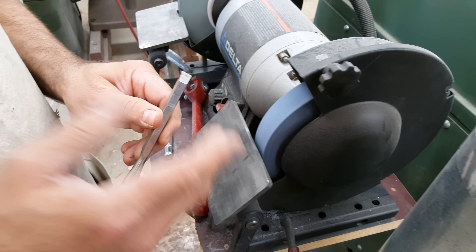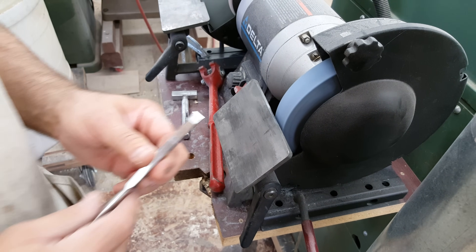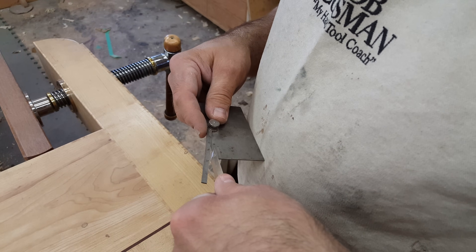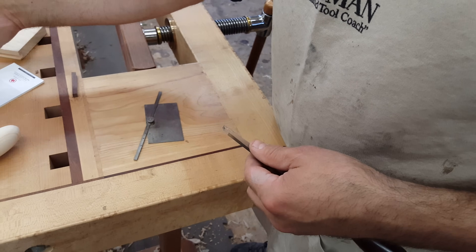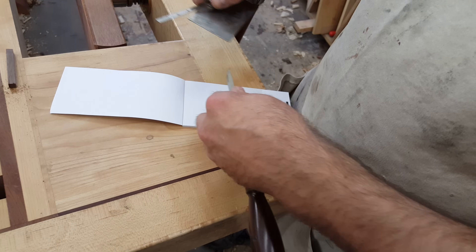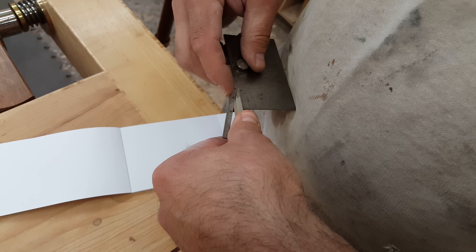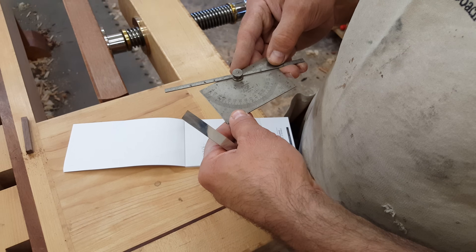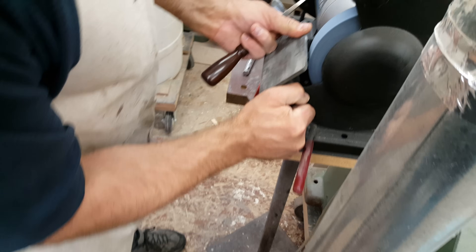The reason I don't go to 16, 15, or anything lower is that at that acute of an angle you just don't have any material out there to speak of, and your edge is rather weak. Let's try this again — I need a piece of white paper or something directly behind. That's registering at 18, which is really close, so I'll try moving it just a little bit more.